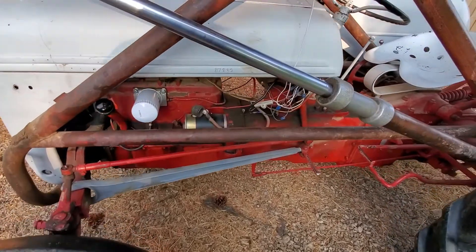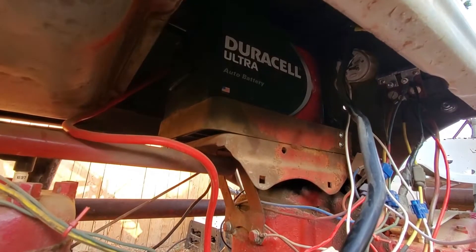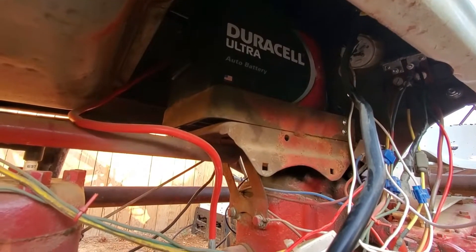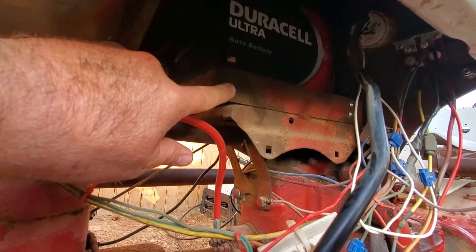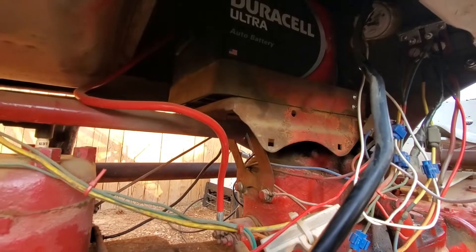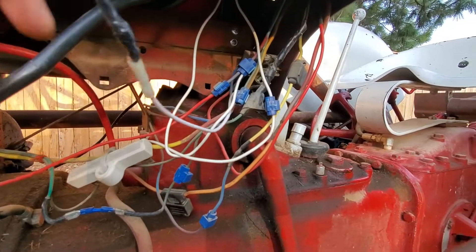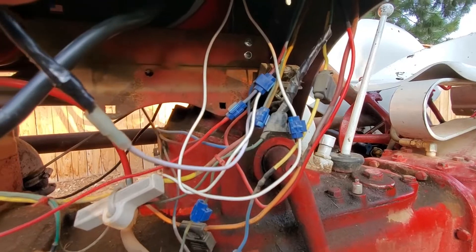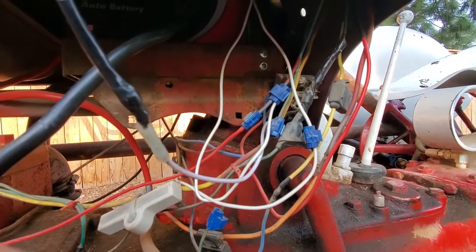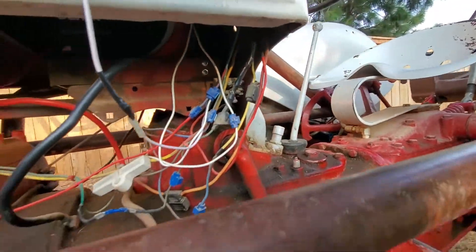Let's take a look at a little bit more on what was done to this tractor to convert it to 12 volts by the previous owner. Obviously they swapped out the battery for a 12-volt battery instead of a 6-volt. Somebody along the way has kind of jerry-rigged this battery tray to make it fit — I have a good battery tray for it but just haven't really bothered with it. All this wiring here is just kind of a nightmare; it's all cracked and been spliced. I'm going to fix that eventually when I get to it, but just haven't really had time. They've also put a headlight switch on it here, which is kind of handy.